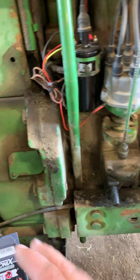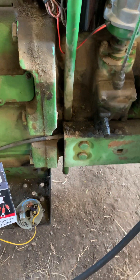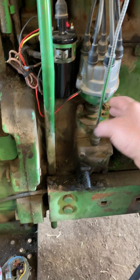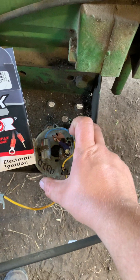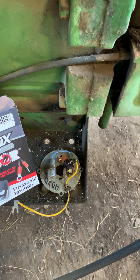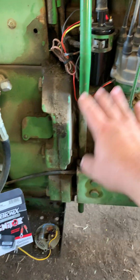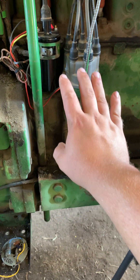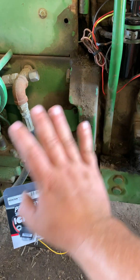When you get your kit and you know you got the right stuff, pop your distributor cap off, take your rotor off. You're going to take the whole base plate — everything, two screws — unscrew them and take the whole assembly off. You're going to assemble your new electronic ignition kit per their instructions. Read their instructions, use their little plastic feeler blade, and pack everything up.